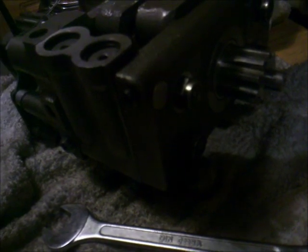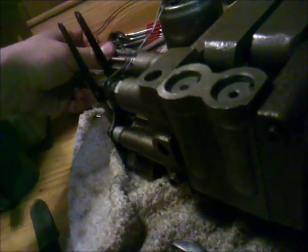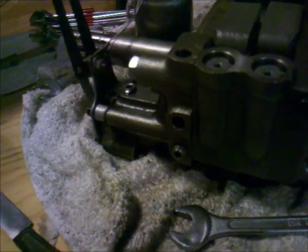Tomorrow — or even today — I will also disassemble the independent power take-off clutch because there are remaining needles from a failed bearing inside the clutch. Nothing wrong should remain inside, as it could cause new damage. So this clutch also has to be removed and inspected to confirm no old remaining parts stayed inside. I hope you enjoyed this video — I'll keep you updated. Please comment, rate, and subscribe. Thanks for watching, goodbye.